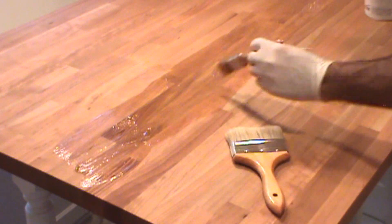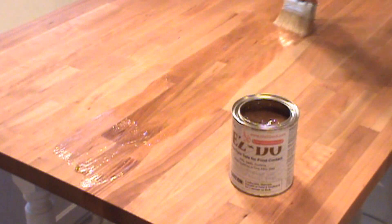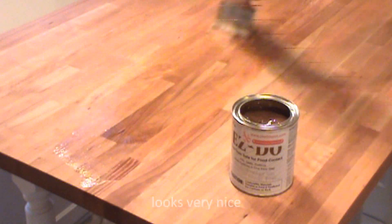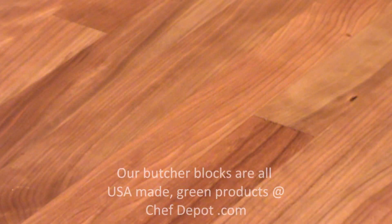I've got a nice amount of it here for the middle. I'm going to switch to the large brush and just make long strokes back and forth. You can see it's already looking pretty good. Brush strokes should go with the wood grain. You want to follow the wood grain and spread it out nice and thin, nice and even.